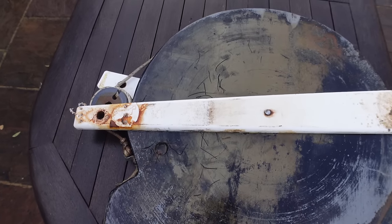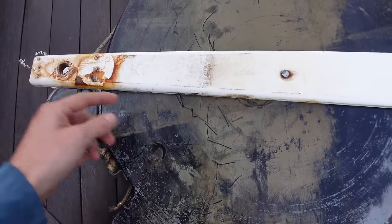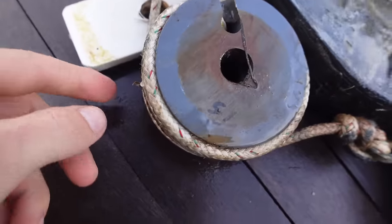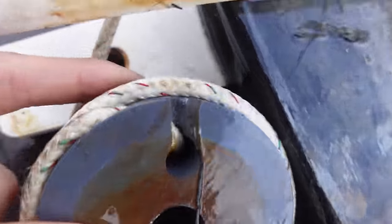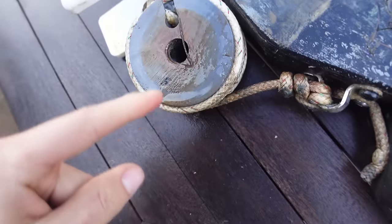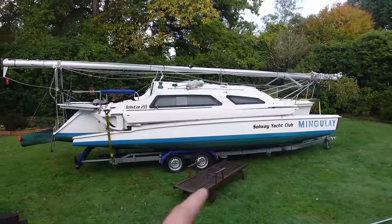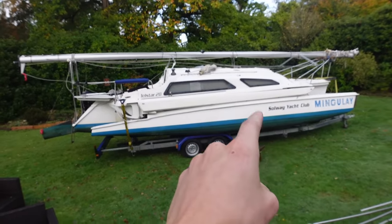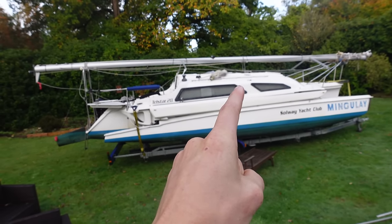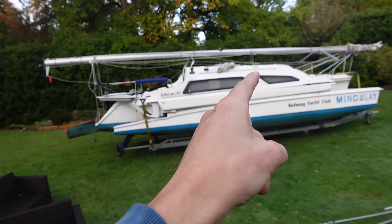It's almost November, so not long. I'll be able to reuse these plates - literally nothing holds them on, just a pin. The other important thing is this drum - it's a continuous rope that wraps around, and there's a little grub screw which pinches the rope as it passes through and loops back around. I'll probably replace this rope and get a fresh one in. I've filled in the hole there. I've got one of the mast-raising poles - the little scaffold ones - away because it's bent. I'm going to try and get it unbent, and it also needs a little clevis fitting to go onto that chain plate.